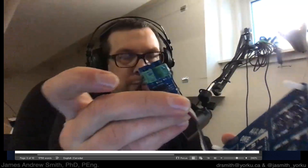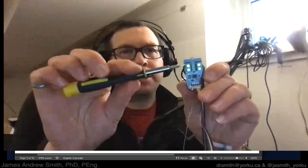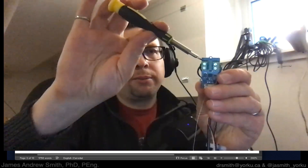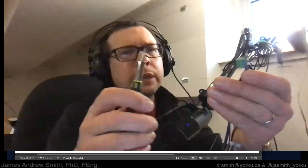You have to connect the pump into the MOSFET switch. The MOSFET switch has two terminals that require a jeweler's screwdriver or fine flat-head screwdriver — you turn it to get the wires to stick into the holes. On one side you have the power supply connections: the bottom terminal is positive and the top terminal is negative. Black is negative on top, and positive five volts goes on the bottom — in my case I'm using a 12-volt supply, but 5V, 9V, or 12V should all work. Four AA batteries will give you about 5 to 6 volts.